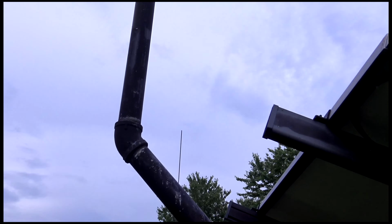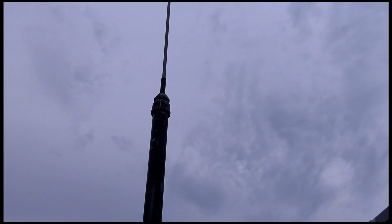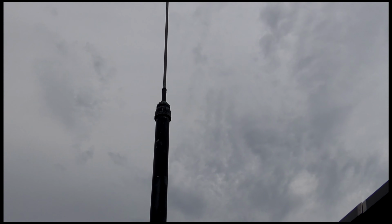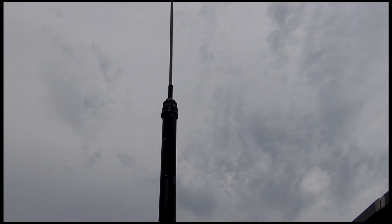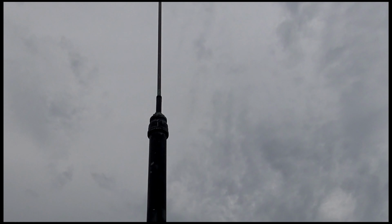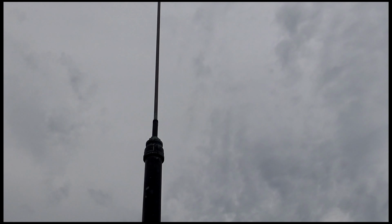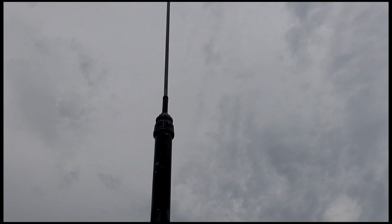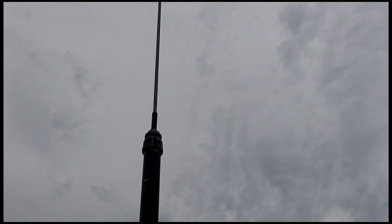Comes up. And then right there, it connects into, I think, like a 1/2 inch nipple of some sort that's 6 inches long. And then I got a copper grounding rod and soldered that in to the nipple. Just filled it up. And then that just sticks up in the air. And there's 2 of them.